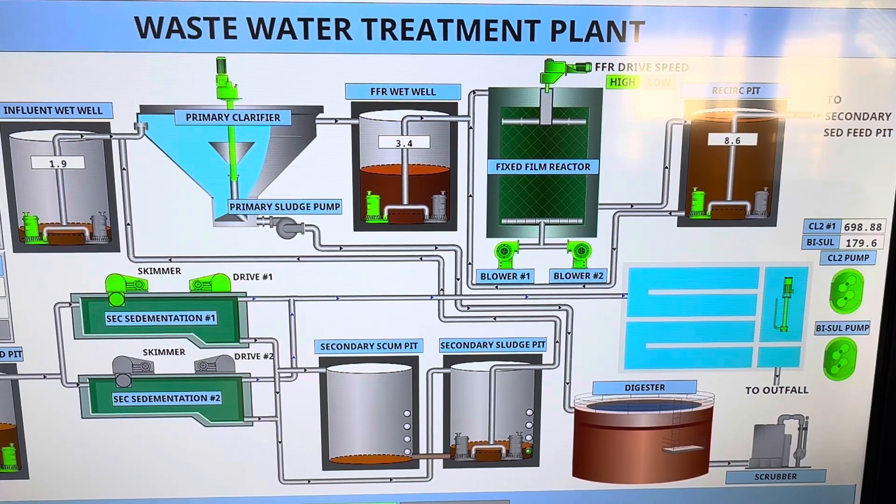For those of you who know what's going on here — these are ORP readings. They are not concentration readings. I don't have 700 parts per million chlorine; that is a millivolt read. My parts per million in the contact chamber is probably around a two right now, free available. Mostly the plant is putting out denitrified effluent right now with very little chlorine demand — that's why you see such a great number, and that is also millivolts. This is our dechlorination system. So you can see primary, secondary, tertiary. In our other plant we have preliminary through micro screens, a physical form of tertiary treatment through membrane filtration, a biological form through nitrification and denitrification, and chemical tertiary treatment through chlorination and dechlorination. Tertiary can be physical, chemical, and biological. Primary clarification and preliminary treatment is typically physical, and secondary is always biological.